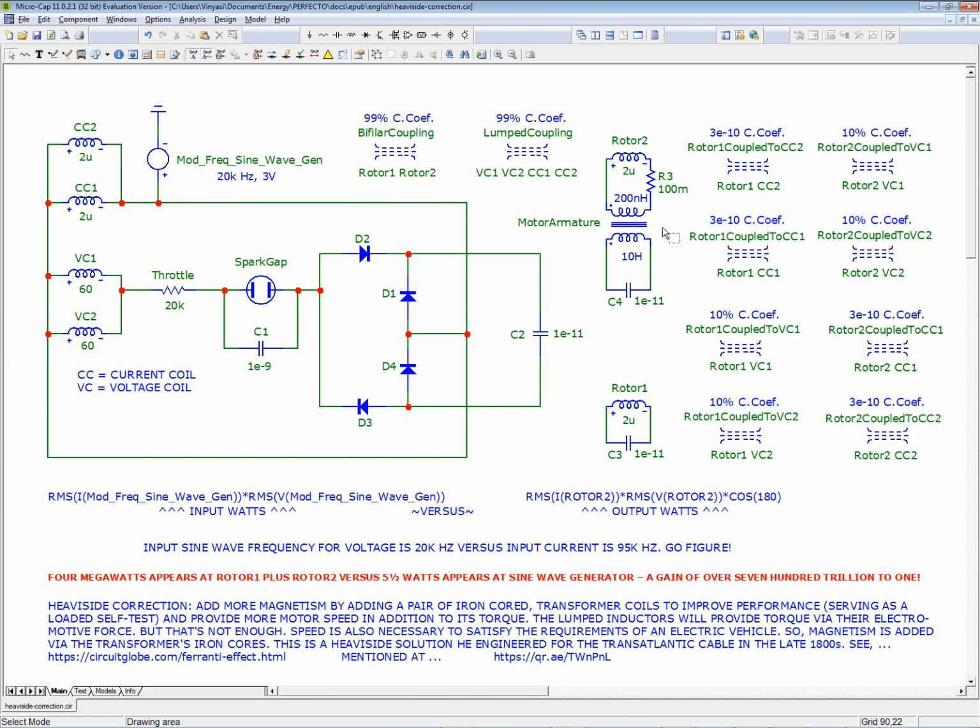You want to bring down your overall power, but you also want to bring down your amperage to voltage ratio to reflect the fact that just because you're running an AC motor, an AC system, doesn't mean the DC is not there. Remember, every half cycle it's DC. It's the change between each half cycle of an AC cycle that makes it AC. The current reverses direction, but, well, the voltage reverses direction as well. Everything reverses direction. But during the duration of each half cycle, it's DC.